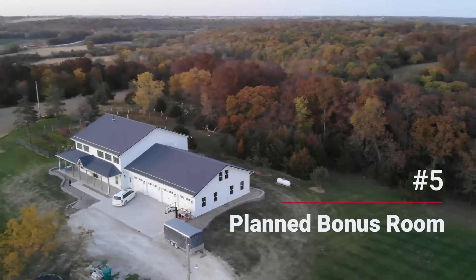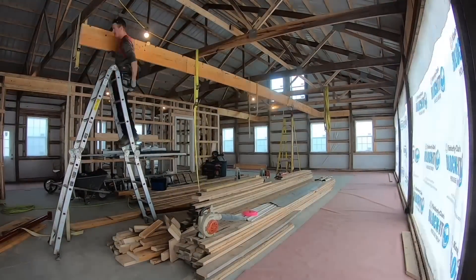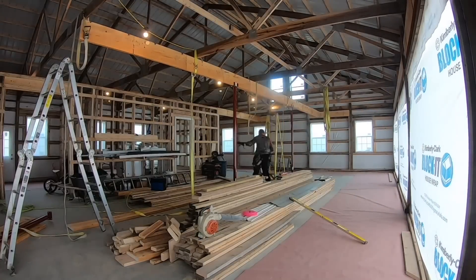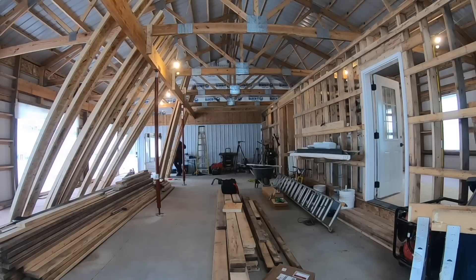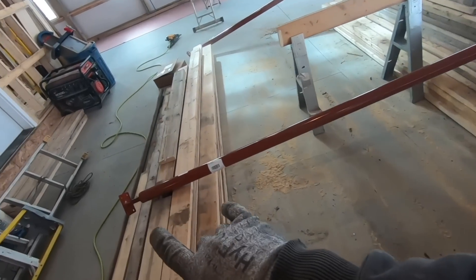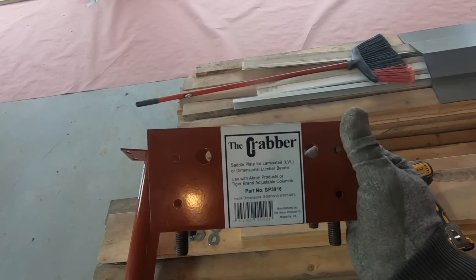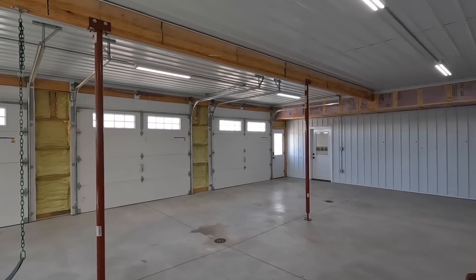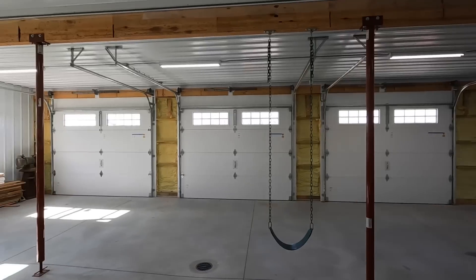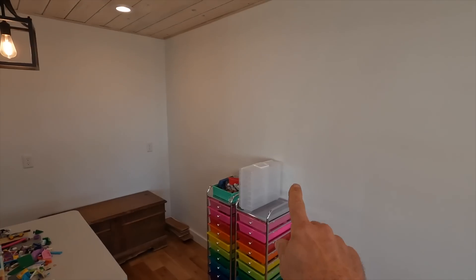Our garage is 56 feet long and 40 feet wide, and with a 5/12 roof pitch, while I was building I thought there was so much space up there. So I decided to add an LVL header all the way down one side and put I-joists up there so I could eventually have a 13-by-56-foot room. We had to add those posts because we didn't have our trusses built to support a room up there. Keep in mind: you can have your trusses built in a way where you won't have to have posts — all those trusses are capable of free-spanning even with a room above. It would have been nice not to have the three posts, but it was worth it because we're adding just over 700 square feet of additional living space, accessible from the loft in our second story.